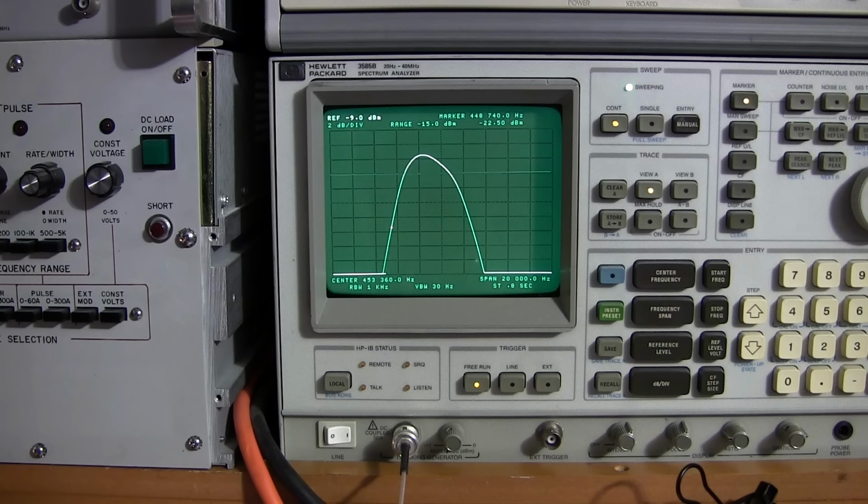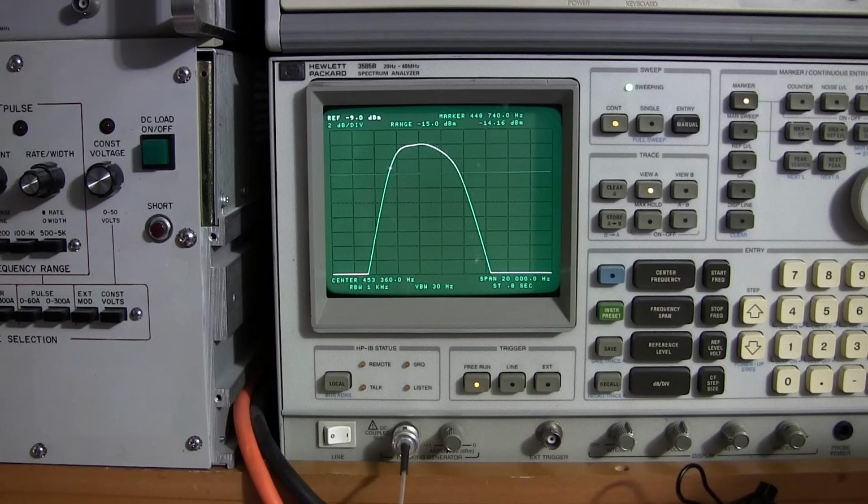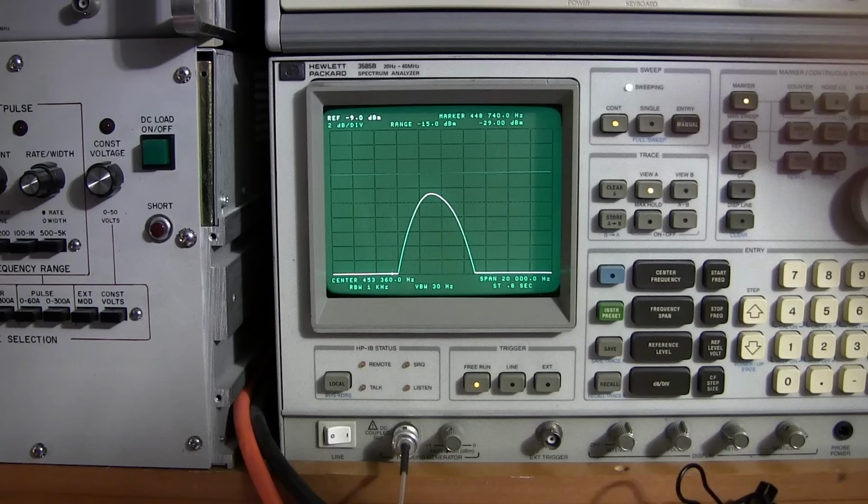So you can see that the center is still quite a ways off. It's moved quite a bit, but that's not a big deal because we're really not trying to fish anything out of the mud or anything like that. With the sensitivity control down, and turning it way up, we're going to be getting more negative voltage on the grids, and you can see how it's moved the center and it's widened it up. That's absolutely fine. Again, don't really worry about that.